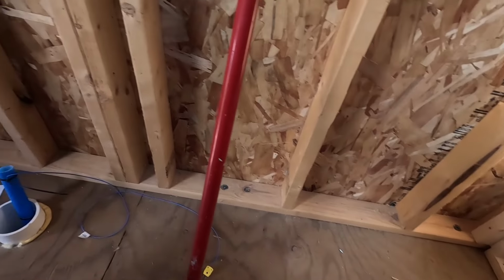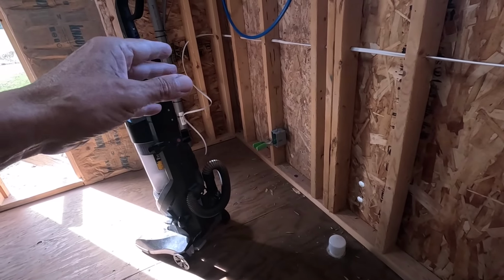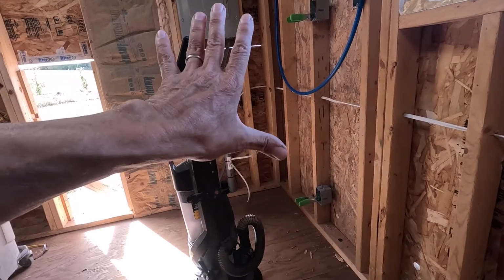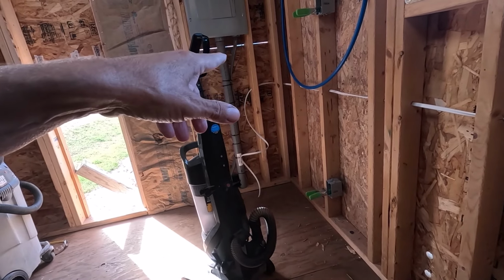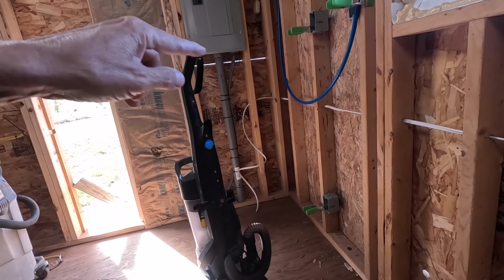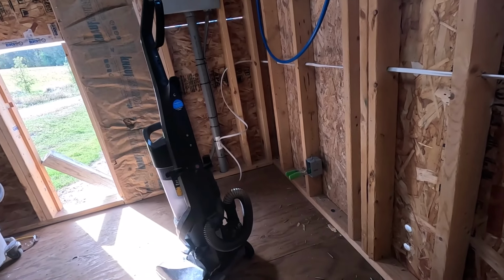Okay, I got all of the nails cut that I could get at. Any of the remaining ones, they're just in the corners there. We're going to push insulation behind them and then insulate those corners before we insulate the wall. I can't get at those, but you don't want to push insulation right over the top of them because you'll have like a tent with no insulation in it, and we don't want that.